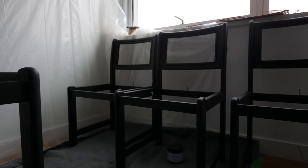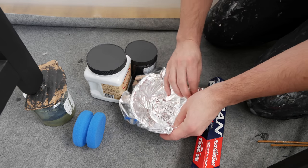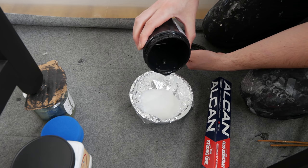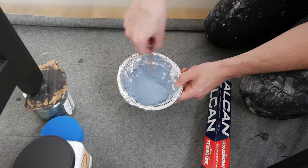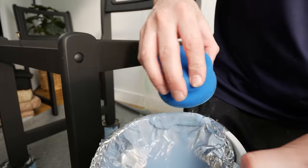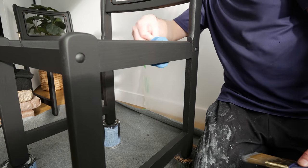Although this paint has a built-in top coat, I'm still going to be applying a satin clear coat by Dixie Belle just on the surface for extra protection, since chairs get a lot of traffic. I use some tin foil, throw it in a bowl, and add a bit of my black paint into the clear coat just so I don't cause any white cloudy streaks on the finish — you don't want to see that on black paint. I'm using a little foam applicator: I wipe it on, take it on the edge of the bowl to wipe off any extra, and then simply wipe it onto the painted surface.